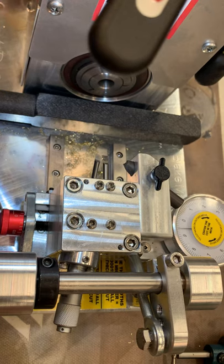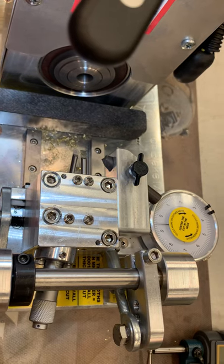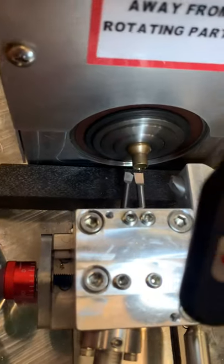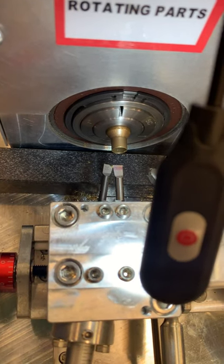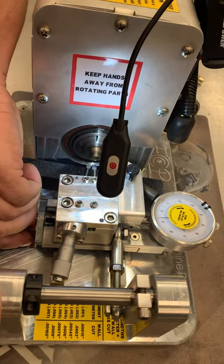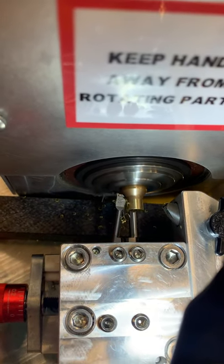It's kind of good to show you what we've already gone over. You can see we're cutting pretty good on the inside, but I can probably still see a little spot where it didn't quite clean up. Before I go any further, I can actually take the indicator and move it even more counterclockwise — this moves the carriage towards us — and it will recut that inside again because the outside hasn't been touched yet. The outside is just barely touching.